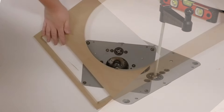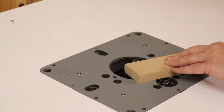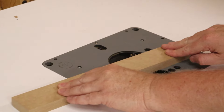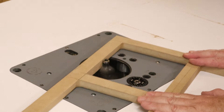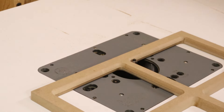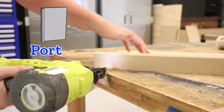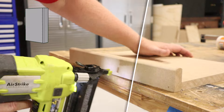You're also going to need a round over bit. I'm going to put a round over on the outside of the outer baffle, a round over on the inside of the port, and a round over on that window brace. Now is also a good time to go ahead and assemble the port, because you're going to want a round over on that inside port radius to get better airflow through the port. Do it now while you have the round over bit in the router. At this point most of the sawdust generation is done.